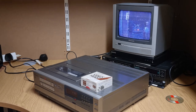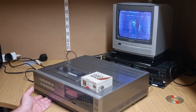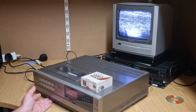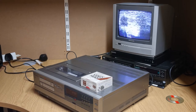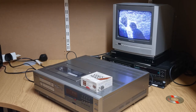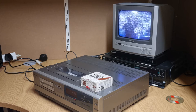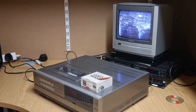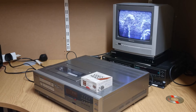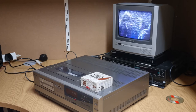There is actually colour in the picture, which is surprising because most of the time this thing has been pretty awful. If I actually move the tracking, that is pretty much in the centre of the tracking control right now. I know this can be capacitors and all sorts of things, however the picture is just so bad I've ordered and got another video head for this machine. This video is going to be about replacing the video head.